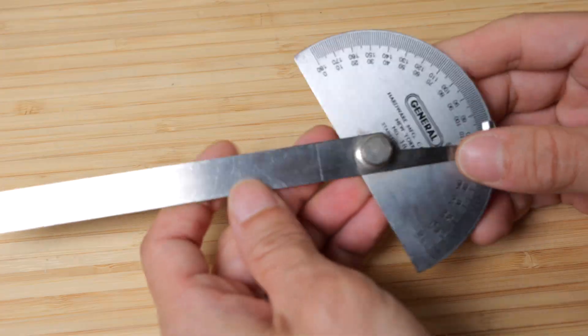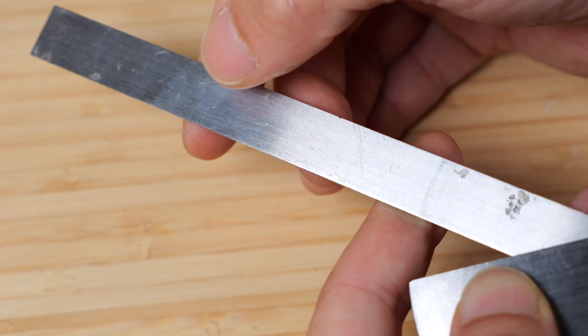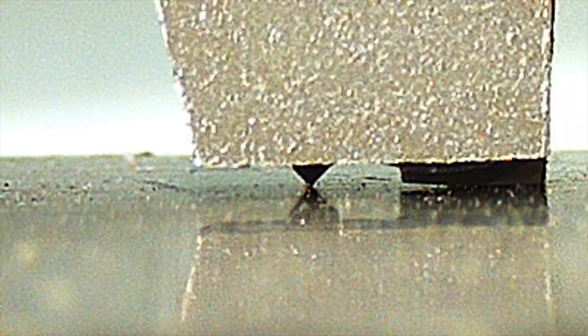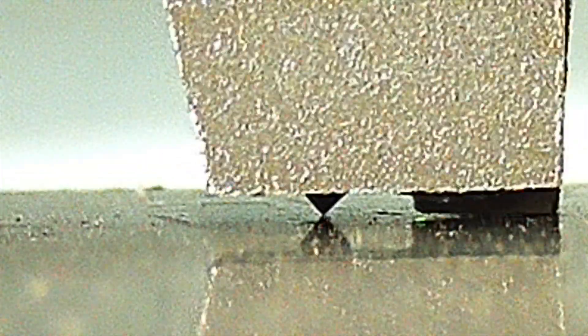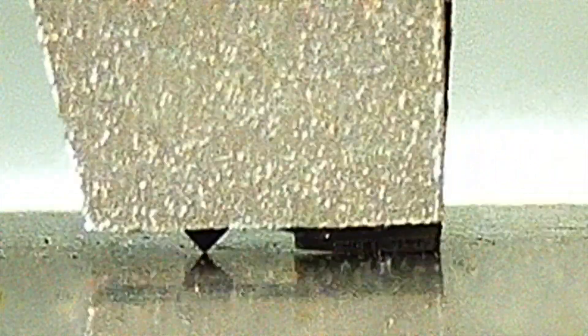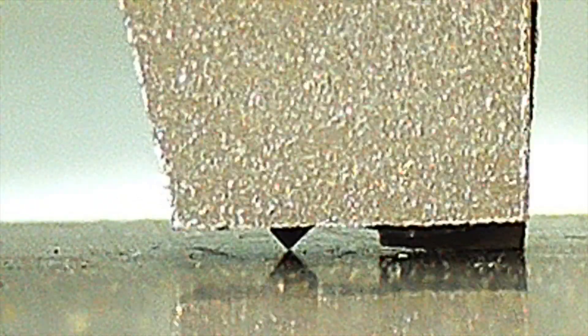The circle scale here is in microns — that's 100 microns, and that's 1000 microns or one millimeter in diameter. Each of those little squares is also 100 microns. I have an angle measurement tool. If I put it against the surface and slide it across — doing this manually with my hand — that little pin is going to dig into any tiny little grooves as it moves across, and the average movement of that pin is the reading you get.